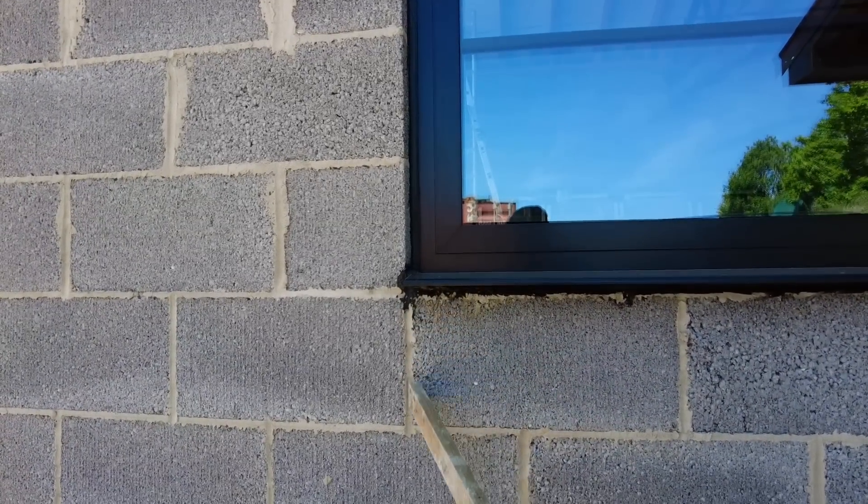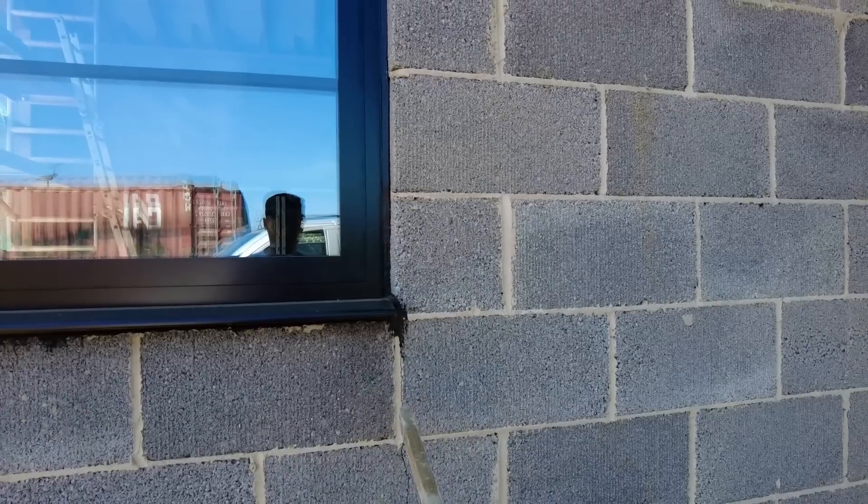The first thing you notice — there's your perp bang on the end, and there's your perp bang on the end. That is bad practice; it should overlap. If your brickies want to do that, say no — it naturally creates a weak point. It's exactly the same as when you plasterboard around a corner: you don't put your joints on the end.